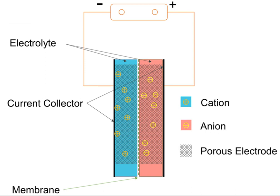Ruthenium dioxide in combination with H2SO4 electrolyte provides specific capacitance of 720 F per gram and a high specific energy of 26.7 Wh per kilogram, or 96.12 kJ per kilogram. Charge-discharge takes place over a window of about 1.2 volts per electrode. This pseudocapacitance of about 720 F per gram is roughly 100 times higher than for double-layer capacitance using activated carbon electrodes. These transition metal electrodes offer excellent reversibility, with several 100,000 cycles.